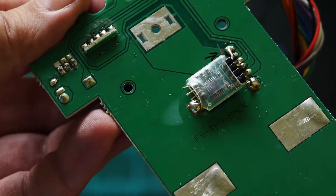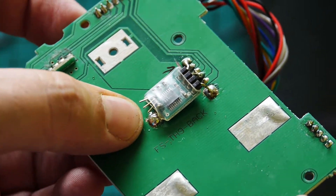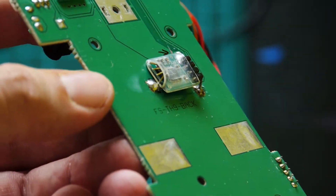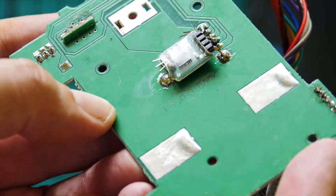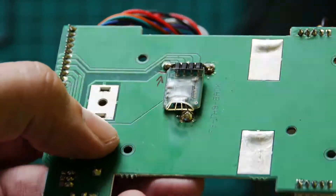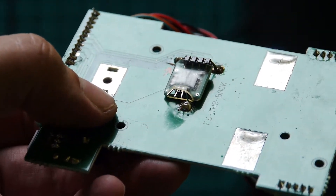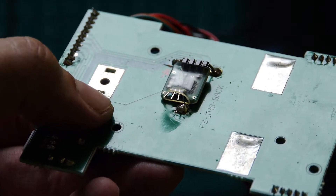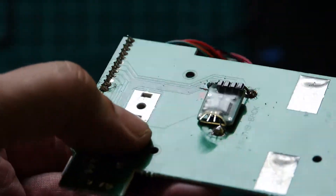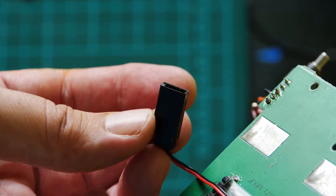On the back side: pin one, two — pin three is free for now, it will not stay free but for now it's free. Pin number four is again on ground, on minus. Now on these three pins we attach a servo cable for connecting TX and RX from and to the CPU. And one wire for plus five volts. Here is the result — female servo cable connector. Classic servo extension cable, female.